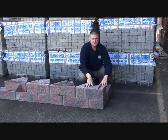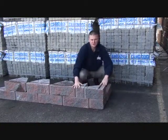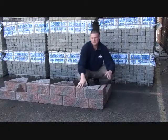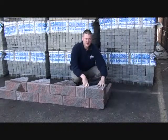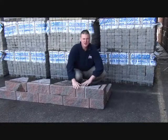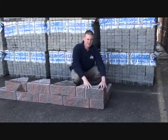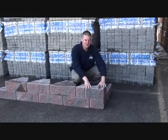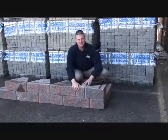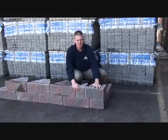With the Viking Wall System, you will never cut the corner. Install your alternating corners and cut your adjustment stone to complete your wall run. It is essential that you do not cut the corner units — install your corner units and make your cuts on the adjustment stone next to your corner units. Once again, it is important that you do not cut the corner units.